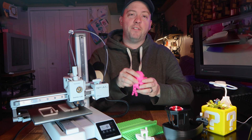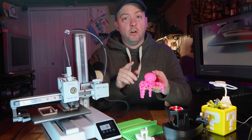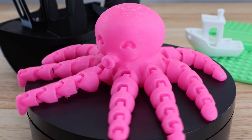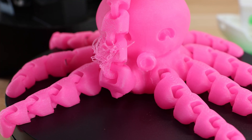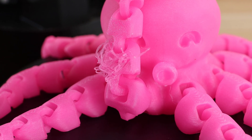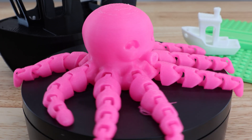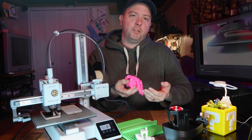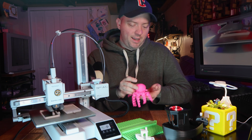Next, I printed one of these flexible octopuses — octopi, whatever — and it turned out good, except for my biggest issue yet. I don't know what happened since I wasn't watching, but it looked like the first layer wasn't where it should have been, so layer 2 didn't have anything to adhere to on a small section of its tentacle. My daughter's going to play with this just the same, but this is the first time I've had an issue like this since my old original Ender 3 version 1.